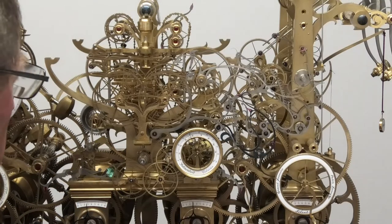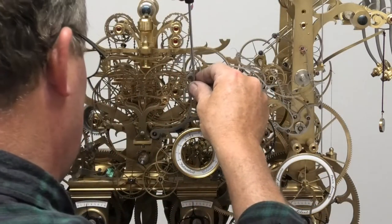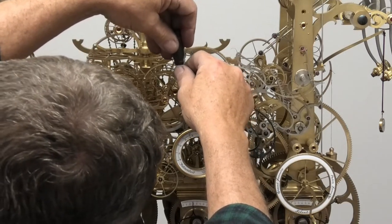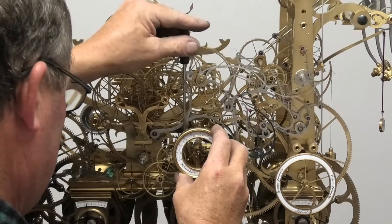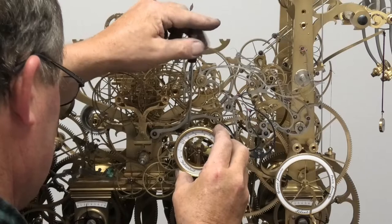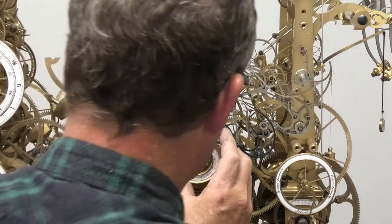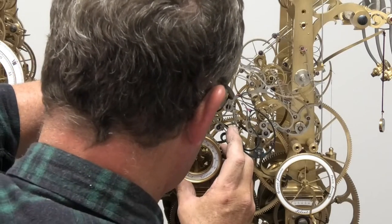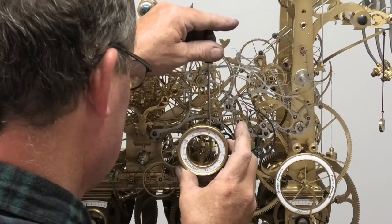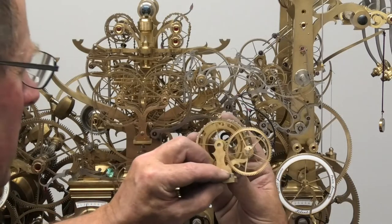The thermometer is removed in the same way. There is access to the two screws on the main calendar cock from above, and it is easily removed. It's helpful if one removes the screw completely. And the thermometer and the transfer gearbox behind it is removed.